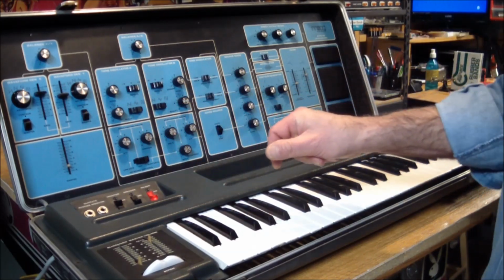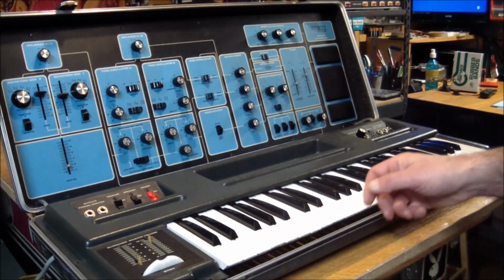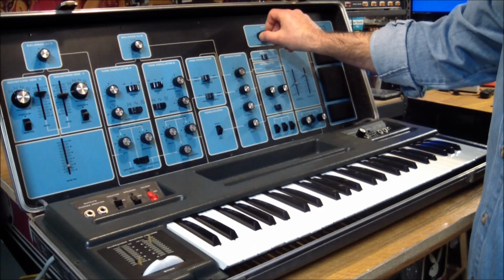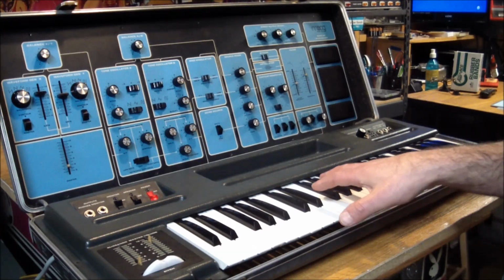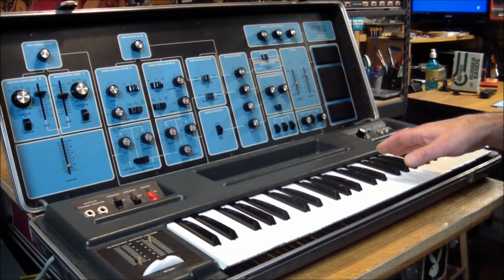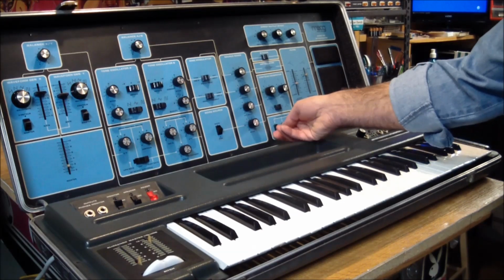Okay, let's shut off the modulator here. Looks like it's working. Okay, why? Oh. These are labeled direct output mixer, and I think what that means is it doesn't care. It just routes the oscillators both to the output. That's why it's on all the time. But it wasn't droning. The keyboard was actually changing the pitch. Oh, okay. So now we enable the keyboard trigger.